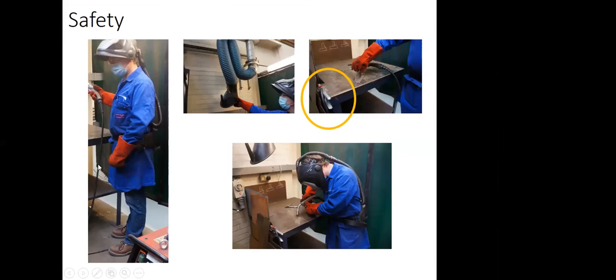You will see that. So you can see the welding gloves is quite important. The welding mask with air supply. So this air supply is giving fresh air into the mask. He will tell about this anyway. Safety shoes, of course, and flame retardant coat. Proban coat, it's called. And we have some other equipment like local exhaust ventilation, LEV, to remove the fumes and to keep the welder safe, right? So that the welder will not be poisoned by the fumes.